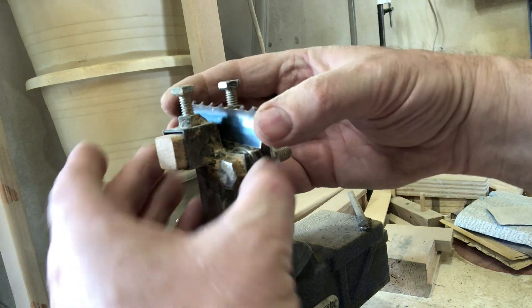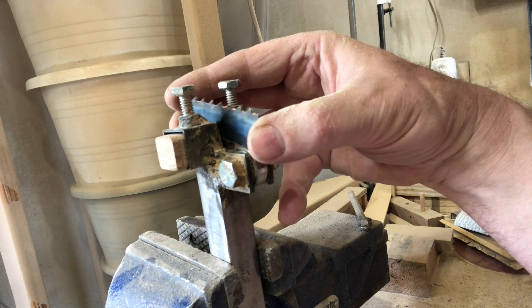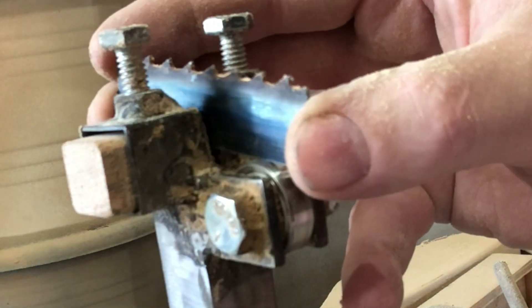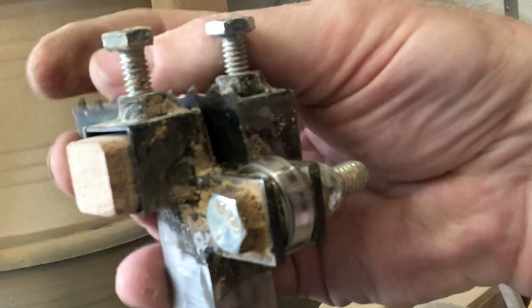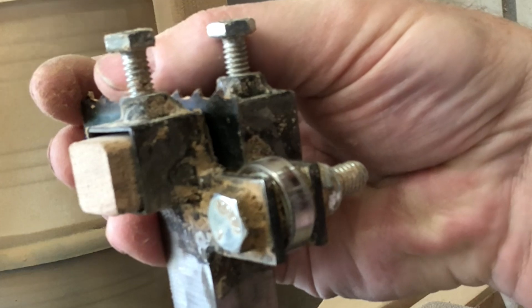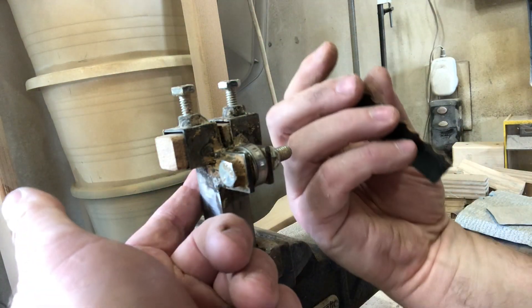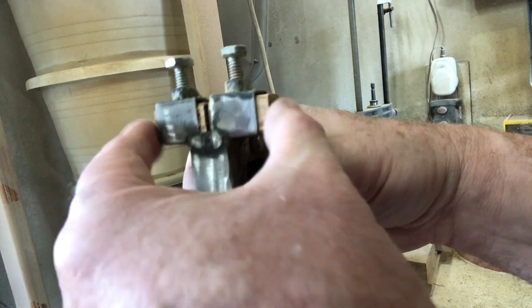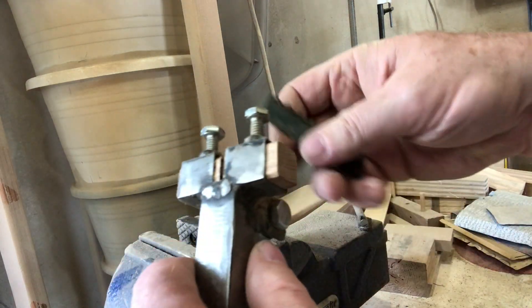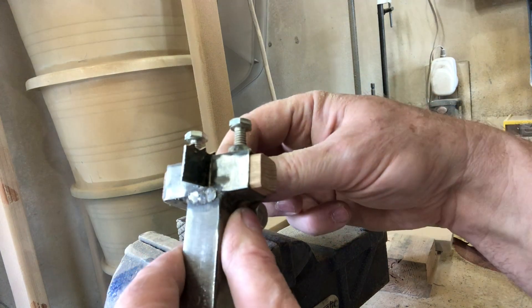The second thing, and I think what's causing a lot of problems with drift, is that this is sitting pretty high such that currently the blade guides themselves are only grabbing about — I'll try and zoom in on this for you — the blade is only about halfway into the little guide blocks. I would like it to be more like three quarters of the way in, to get a little better stability on the blade as it's going through just before it goes through the log on both sides. So I'll take this, move it over to here, drop it down a little bit, and make the slot here a little bit deeper to provide a little more clearance for the blade as it goes through these guides. I'd like to be able to get almost the entire blade held in those guides if possible.